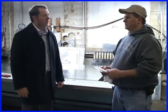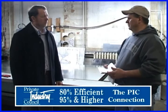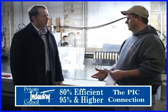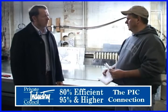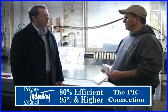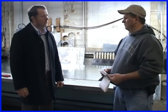Oh, way more efficient. About the highest efficiency we see out there that we are retrofitting is near 80%. On some instances, they have a higher efficiency furnace, but due to the way it's operating and installed, or oversized, the efficiency is way low. And we check those and come up with the best fit: how oversized is the existing equipment, and can it be reduced in size.